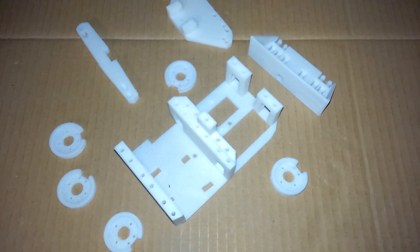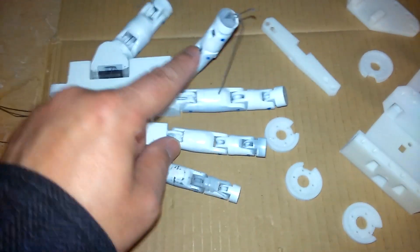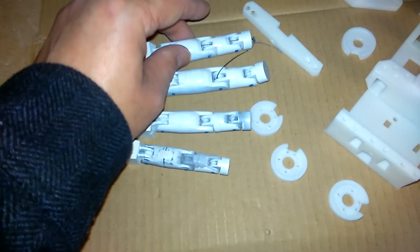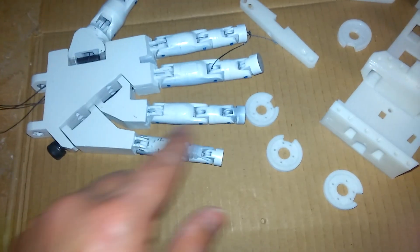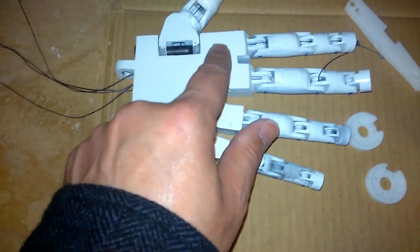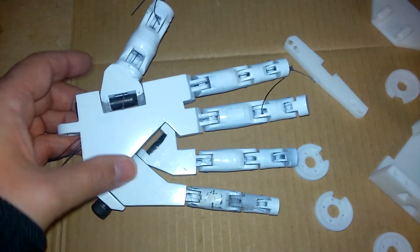So there's going to be three main areas to work on this time. First, I'm going to be coming back to the hand, revisiting these fingers. Some of them are very loose and others are still a little bit tight. I'm going to remove all of the pins and re-drill some of the holes out to 3.2mm because they're only drilled to 3mm at the moment and are a little bit tight still. We want them to be nice and loose for when the servos are driving them. I also need to sort out that bolt - the head is still a little bit proud so I need to take it out, shave a little bit off the end, and put it back in.